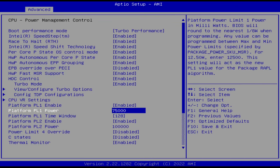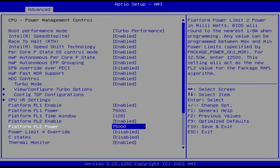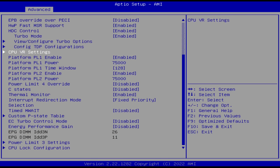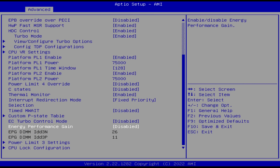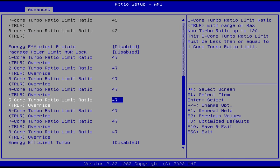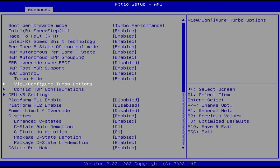Let's get on to the other results with this motherboard, where if we decide to take it to 75 watts manually after tuning in the BIOS, this is where we can lock in 4.4 GHz with an undervolt of 50 millivolts in the offset. Before we get into those VRM results, I'll interject to say the BIOS is tremendously bad — especially when you need to be locking in XMP profiles on a dual channel memory configuration and getting the highest clock speeds possible.